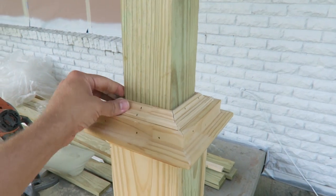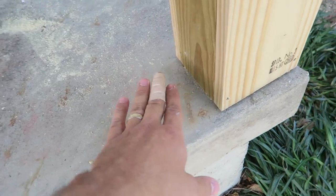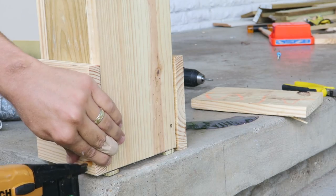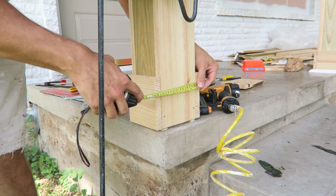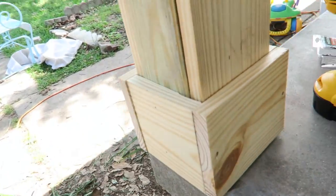Okay, now I've got the caps in place — they're all nailed down and filed. With my base down here, I'm going to use leftover 6x1s and make a nice bulky base trim, and then right at the edge I'm going to use quarter rounds. I got the base trim on and added some trim screws for added measure just to keep it nice and tight. This is PVC trim — it's waterproof, and it's going to be perfect for the bottom because it's going to protect the wood from water.